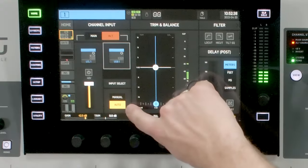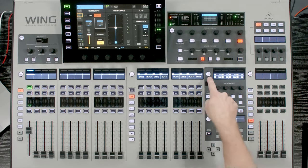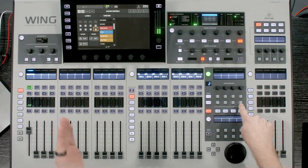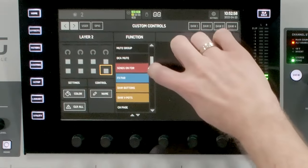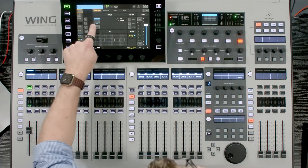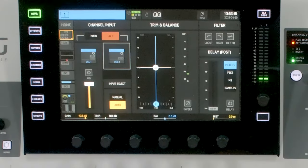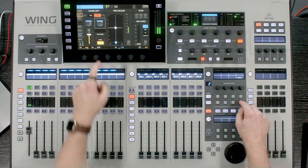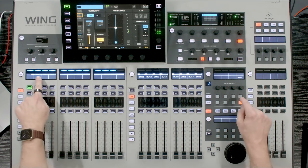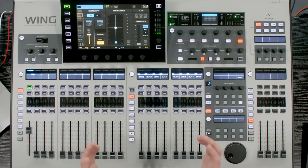I can go over to my user custom controls and press User, then press View, and page up to two. I'm going to define a button as my main-Alt swap. I'll go to Other, then Global Main Alt. Now we can see that if I go back to my channel, it's currently set on User, and I can press this button and it will switch to Alt. One thing to note: if the input select is set to manual, it will always stay on whatever it is set to. We can see that all of my channels are swapping except for channel one. And now if that's set to auto, it's patching all of them.